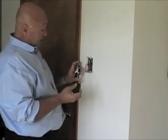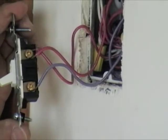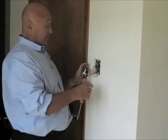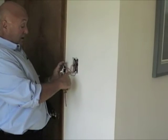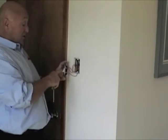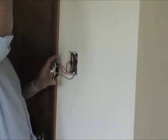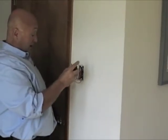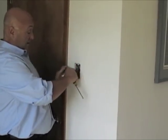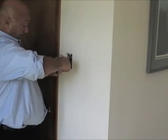You'll see different colored wires. Our red, as you remember from a previous video, is a hot wire. Red, black, and blue are always going to be circuit wires — hot wires. Your purple, in this instance, is a switch leg, and that means it carries electricity from the switch to the light when the switch is in the on position. When the switch is in the off position, this wire is dead and doesn't carry any current up to the light. So we want to start by taking our hot wire off, and then we take our switch leg wire off.